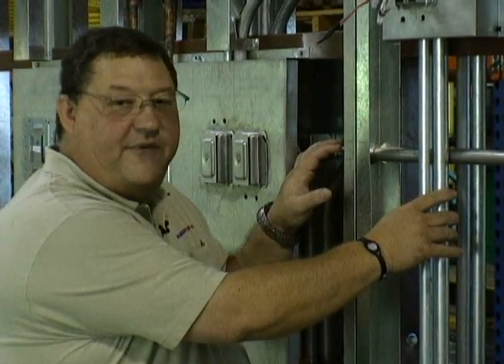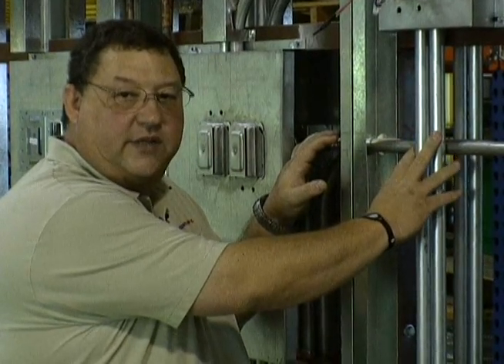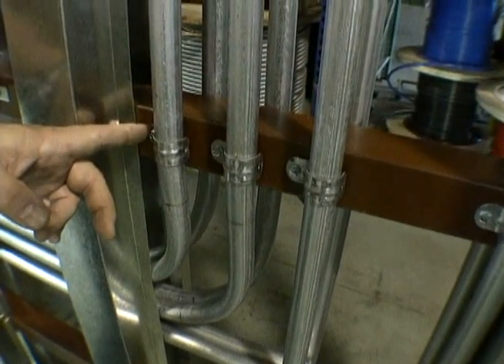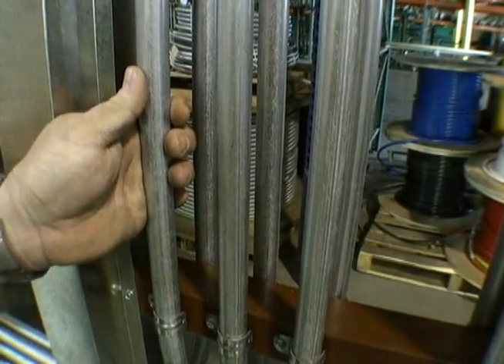In this instance, because we use three-quarter inch conduit everywhere, we've had to create some unique bends. Doing this in a prefab situation, we can recreate these bends consistently every time. Our backbone has provided us a very rigid location for mounting our strut straps so that our conduits do not rattle.